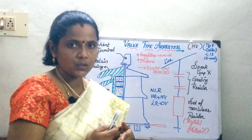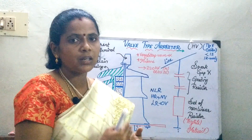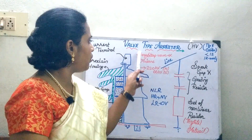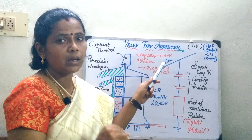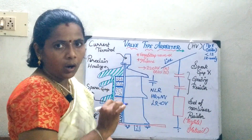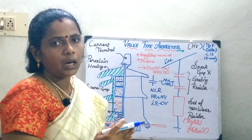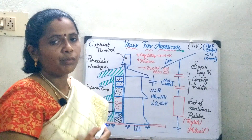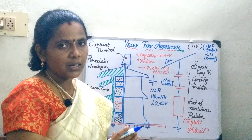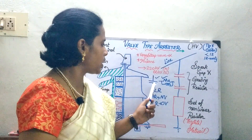Having seen the different types of surge arrestors, the next concept is the surge absorber. Both perform a similar function, but when used as a lightning arrestor it diverts the surge energy to the ground, whereas the surge absorber absorbs the energy. In the case of very steep fronted waveforms, you cannot use a lightning arrestor — instead you use a surge absorber. This can be facilitated by adding a capacitor between the line and earth, or a choke and resistor in series with the line. The choke will not allow high transients to pass to the apparatus, or you can use a Ferranti absorber which does the same function.